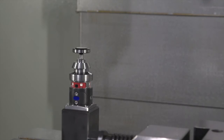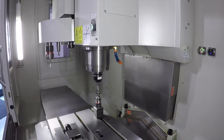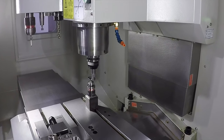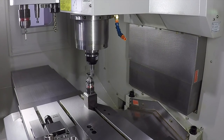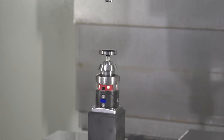If we measure a tool and find an error in the size, what happens? The software is quite flexible. If it's just outside the wear limits, it depends on what the customer wants. It can either flag to the operator that there's a problem but continue the process, or it can physically stop and someone has to intervene. So if this is part of an automation cell, we don't lose production — if the cutting tool goes 0.01 undersize, we can adjust it? Exactly. As soon as it exceeds the wear limit, it will either stop the process or flag an alarm. If the control supports it, you can use sister tooling — bring in a sister tool and continue the automatic manufacturing process.